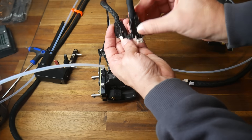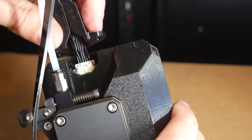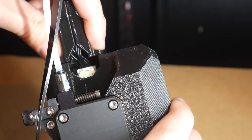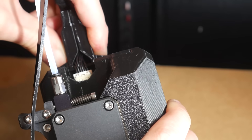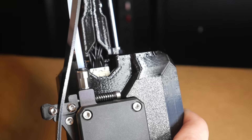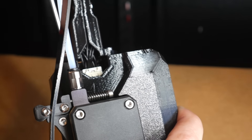The old connector was simply held in place by the connector itself, but the new one has two holes, and after the cable is plugged in as before, there's quite a gap between the two components. As they're forced together, you can see that the wires with this design are pushed really hard towards the connector. An M3 bolt either side is used to achieve this, and I guess one day I'll find out if this is more reliable long term.